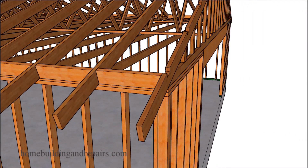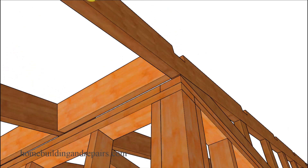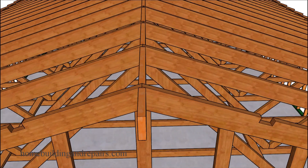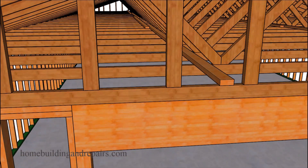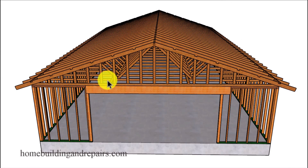If you have a large strap then the strap is going to take priority over the roof truss. Our eave blocks here, and our block here for the fascia board. Basically the lookouts are going to provide us with enough structural support because this block will not be providing much. This is another common method for framing with roof trusses. We will need to install some support backing — these 2x4s will prevent the bottom of the trusses from moving. In our example here we will be installing two of them, basically spanned about one third of the way.